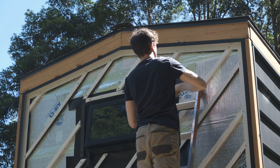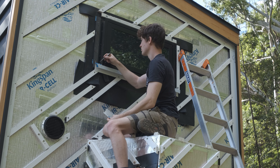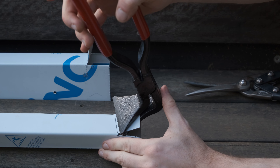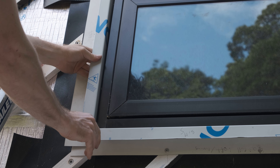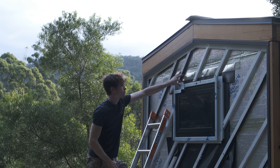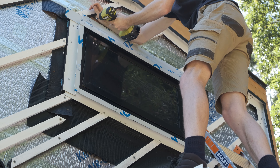With the flashings done, I can pull out the plastic packers between the flashings and trim. For flashing this window, like with the wall, I start with the bottom and work up, but this time I use some offcuts of the same flashing profile to mark out where to cut and bend in each corner. Most people doing these flashings on windows tend to miter the corners — I didn't really like the look of that and thought it would be more work, so I chose not to. Once I've finished fitting the flashings to the windows, I take them all off and peel them.